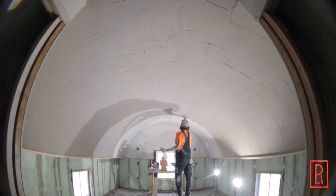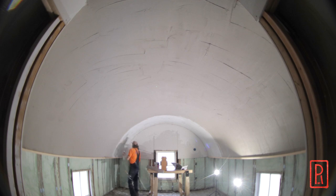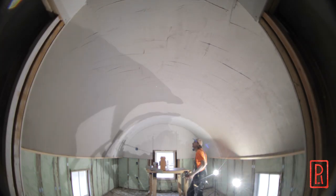After laying all the mud on the barrel vault, I could sit back and let it set a bit before coming back and smoothing it out. I mostly want the high spots and ridges to go away and to fill the holes I left behind when laying it out. Then I went ahead and cleaned up some of the corners and edges before calling it a day.